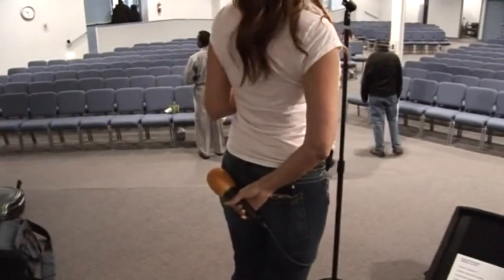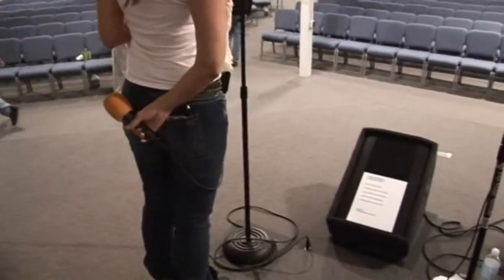Keep the line of sight of the speakers aimed away from the most sensitive parts of the mic. If this is a front-of-house speaker out there to the audience, then that's a good way to go. If it's going to be a monitor, then it should be placed down at your feet. Also train your vocalist to put their mic behind their back when resting their hands — not drop it down aiming squarely at the monitors.